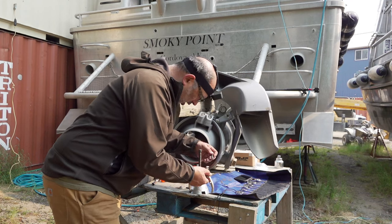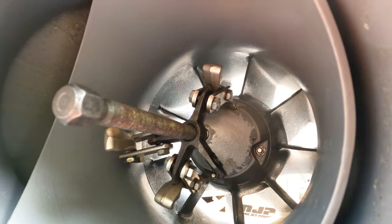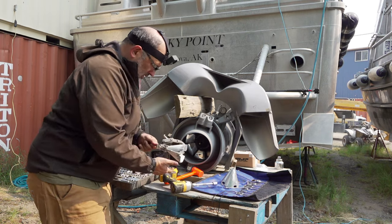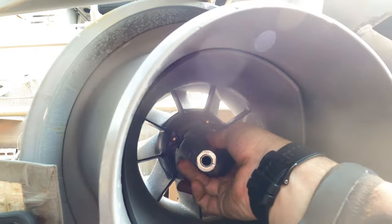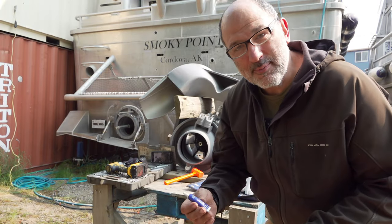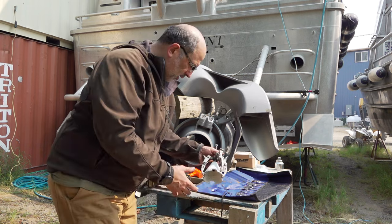After a little dillying around, I got that puppy to hook on two tines. That's what you need — a little gear puller. Now that we've got that one off, this one will go right in there. There we go, just like that. Permatex Thread Locker, medium strength — a little dab will do you. All right, we've got that part done.